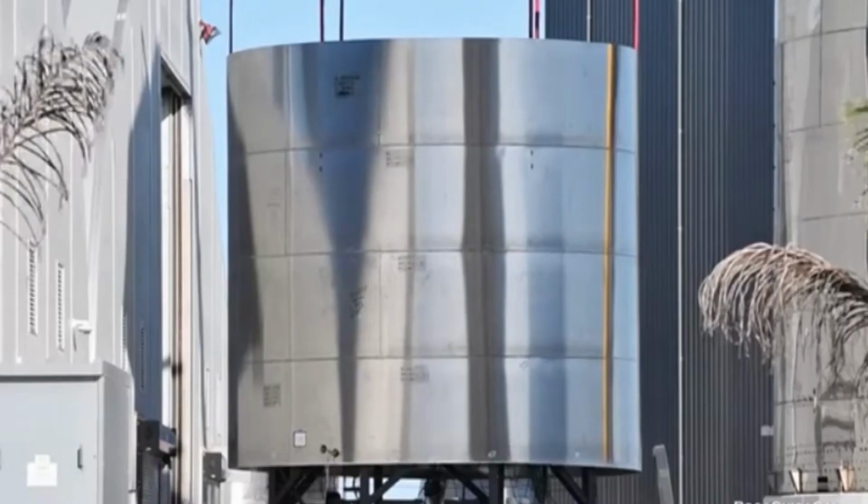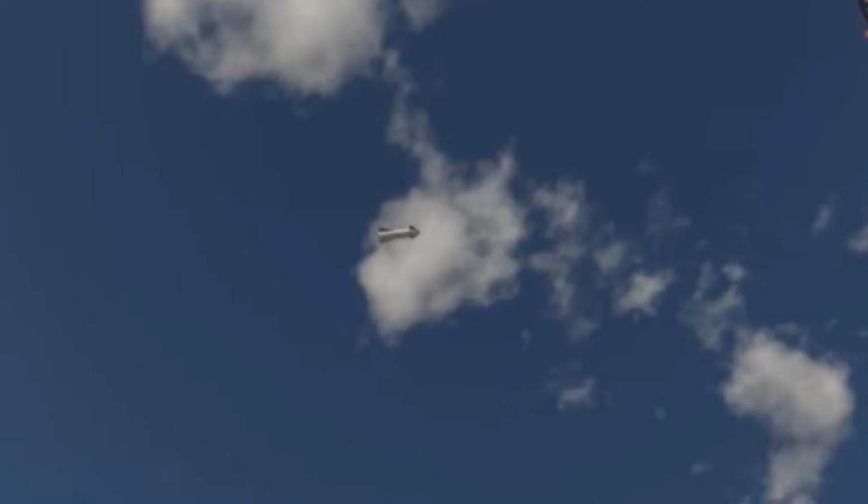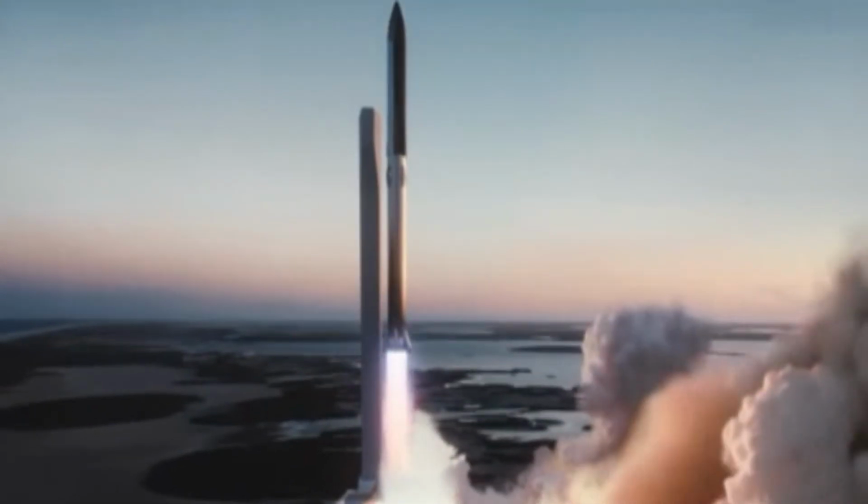When asked by Tim Dodd about the differences of thickness between Starship's and Super Heavy's rings, Elon replied, saying that the ship rings are thicker than they need to be for now. So, the same thickness works for the booster and the ship for hoop stress. The booster's lower tank will have longitudinal stiffeners to prevent buckling.